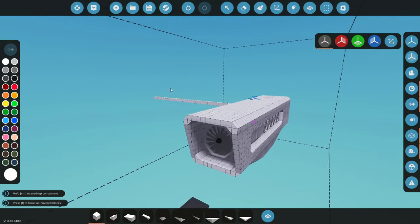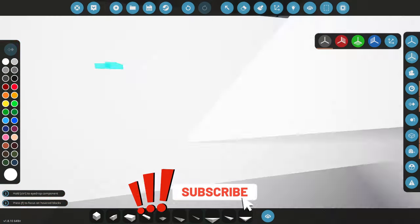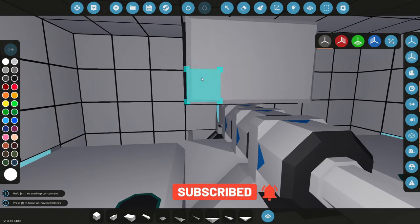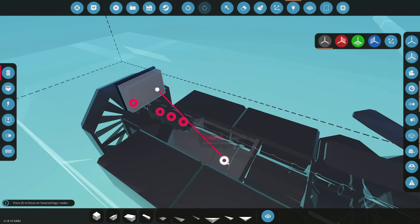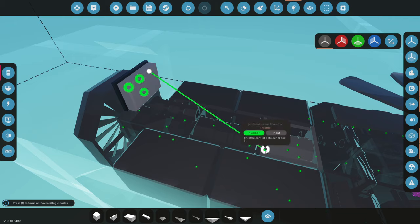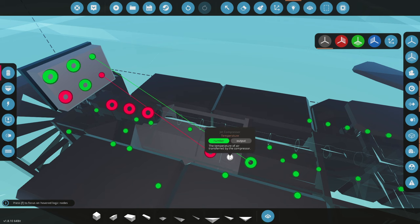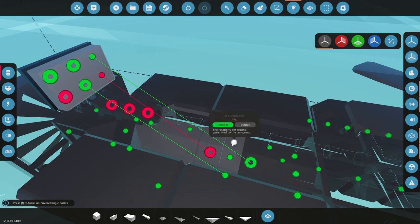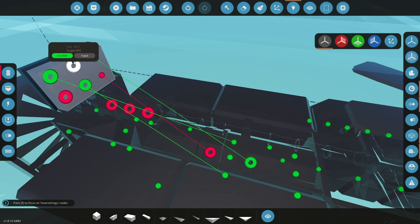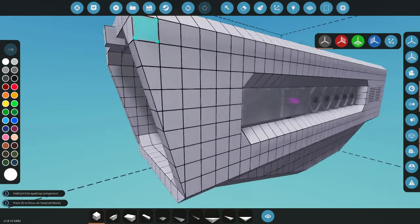Actually, we need a jet controller, so let's get our jet controller first, JCU. We'll plop this in right here at the front. Let's hook this all up, and then when we swap it to the other side, it should be good to go. Starter goes to the compressor, throttle goes to the throttle. Compressor air pressure is right here. Let's see. Air pressure from the compressor. Nope, that's RPS. Whoops. Compressor. We'll unhook that. And our RPS goes here. Now we just need our on-off and our throttle from our seat, and that should be good there. Cool. Perfect. I think we're good there.